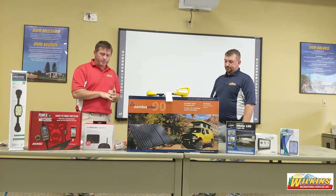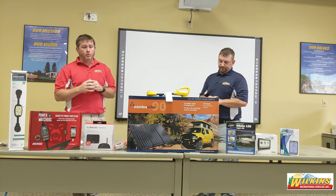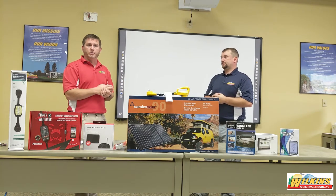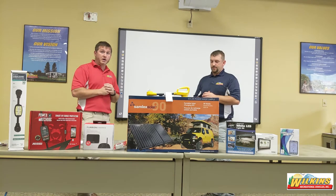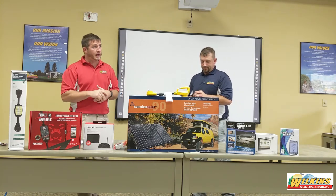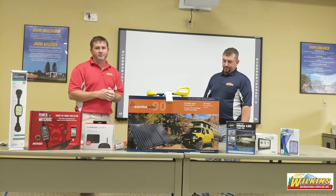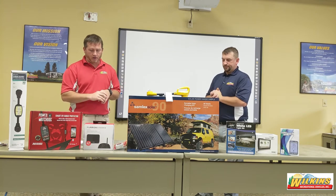Moving on to winter storage: a fully charged wet cell battery with no load on it will not freeze. The question is: do we have a load on the battery after we charge it when we put it away for winter? We recommend disconnecting the battery switch or unplugging the ground wire from the battery for the winter — your battery will be fine in the spring. Another recommendation: take the battery in and put it in a safe area like a garage basement. The myth about setting a battery on concrete is no longer valid — today's battery plastics have surpassed the old draining theory.